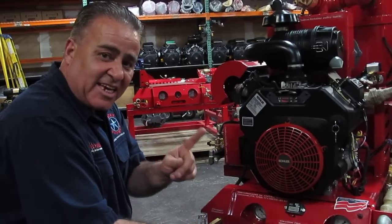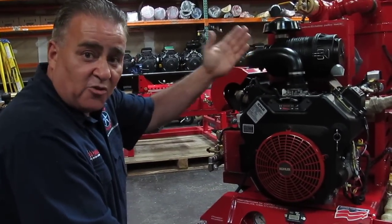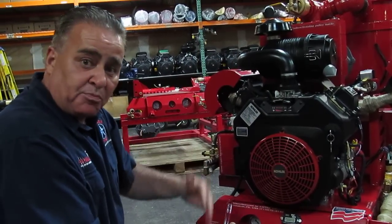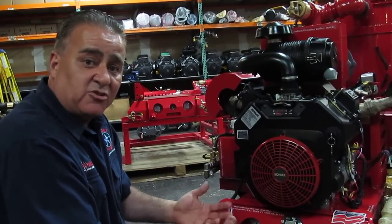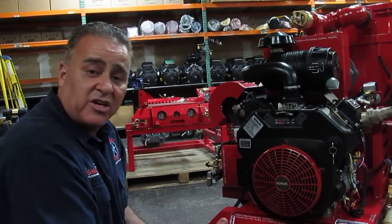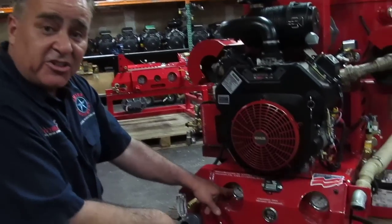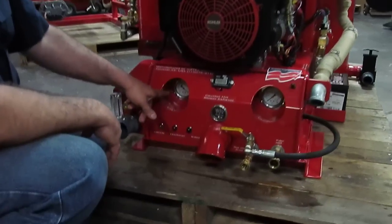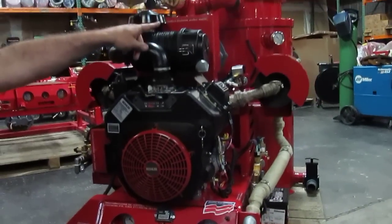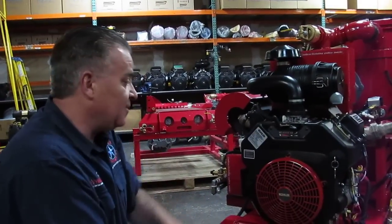That's an indication that you have a clean flow system of air coming into the blower. However, like I said, if you're using this machine after so many hundred hours, and as you block the vacuum, or connect hoses to the machine, it shows a high HG buildup on the front gauge but a low HG buildup on the tank gauge, that's an indication that your filter needs attention. All right, here we go.